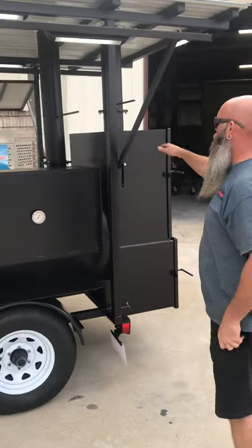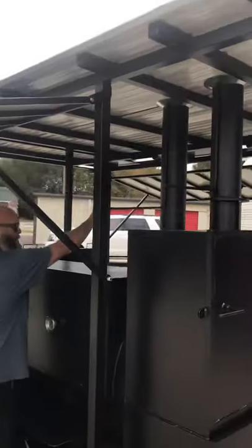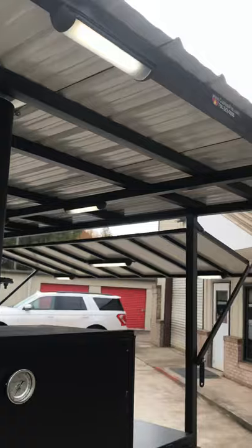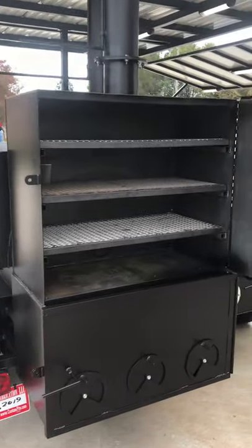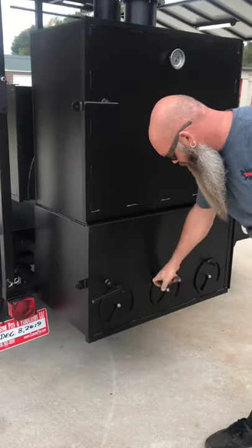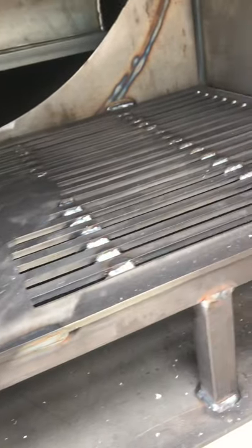All the stacks for the warming box and the smoker are vented out the roof with a positive lock, so you know when it's closed and when it's open. Both of them are flanged with gaskets so they won't leak. The warming box has three racks — plenty of room. We've got an upgraded restaurant-grade firebox where the vents are quarter-inch. The firebox is quarter-inch and we CNC-cut the grate on the machine, so there's no expanded metal inside the firebox. That will last a lifetime.